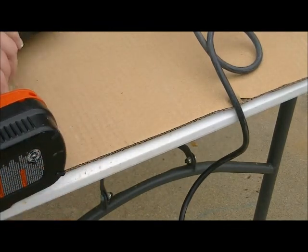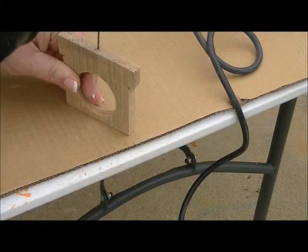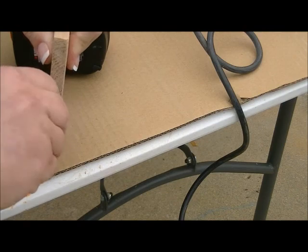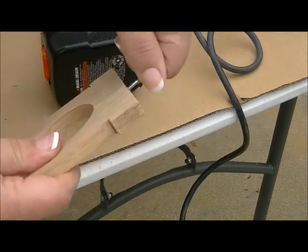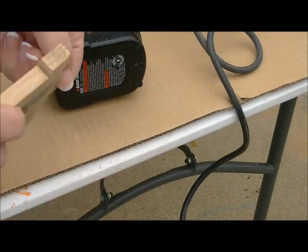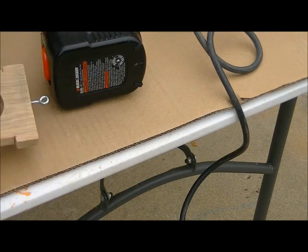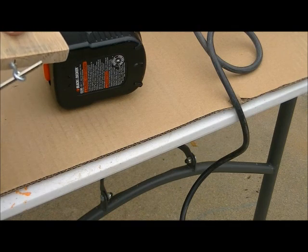Then we're going to remove the shaded areas and give our ornament an overall sanding. I've made a mark in the center of the top of my ornament — I'm going to drill a hole there for our eye screw. When you're screwing in your eye screw it'll probably get tough after a certain point, so you can stick a pencil or screwdriver in there. I have an Allen wrench here from IKEA — I'll stick that in and continue twisting until it's all the way in.